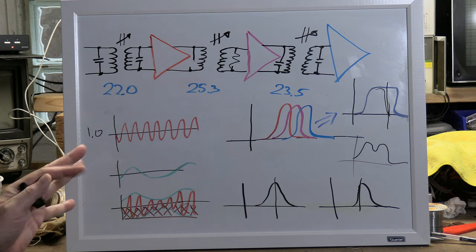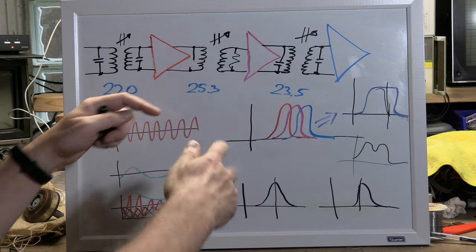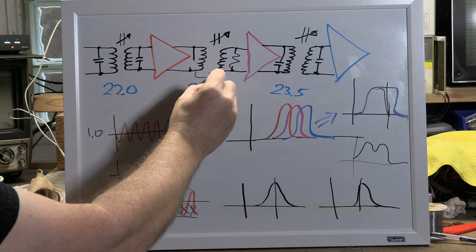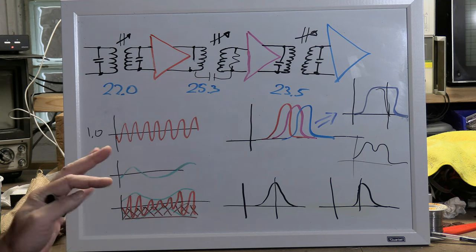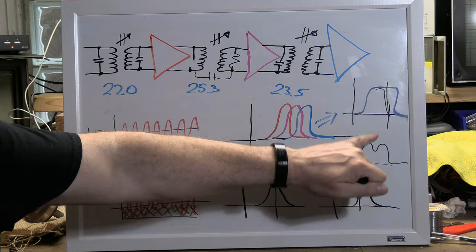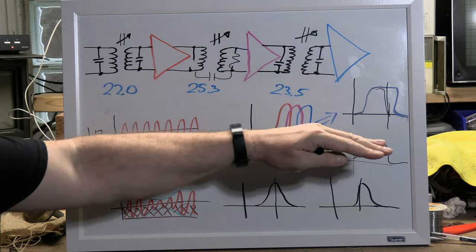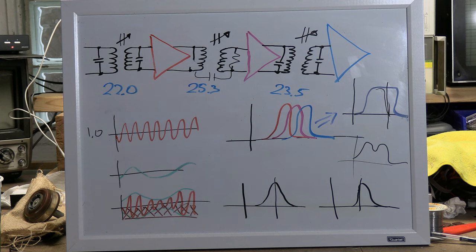There's also something called overcoupling, where, I forget the exact technique, you either wind the coils on top of each other, or there might be some additional coupling between them, which, again, has the effect of widening it, but not ideally, where you get the same type of double hump response. So that would let them get by with 2 stages, but it'd be reduced bandwidth, and there'd be a dip in the middle, and the sides wouldn't quite be as straight either. So those are your various techniques.